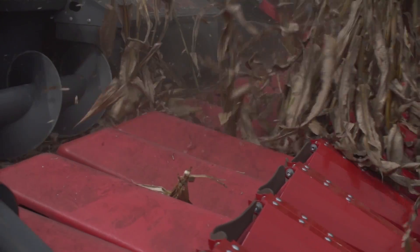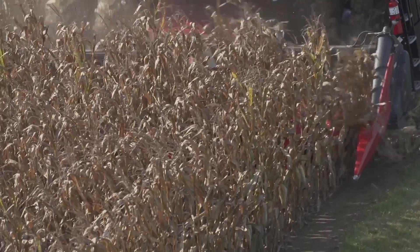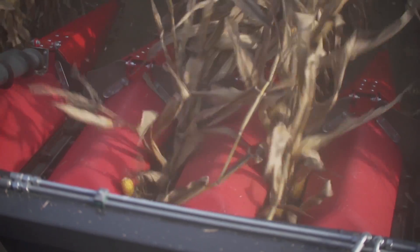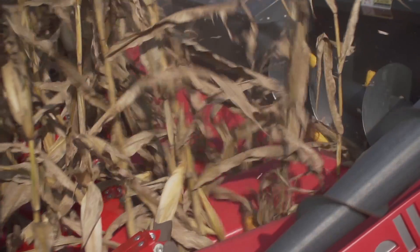It will process without adjusting — you go right into the field and just harvest corn. If you're a custom harvester having to do 20s, 22s, 15s, you now have one head that you can use to harvest all rows. This head is a Capello, so it's using our standard chopping unit, giving you that great chopping action. We also now have a deck saver deck plate with a raised bevel that keeps the corn in the head rather than dribbling down on the ground. So even though this is a multi-row head, in many cases we'll shell less corn and leave less corn on the ground than many conventional heads, allowing you to harvest more corn.